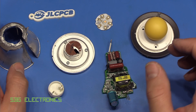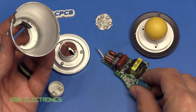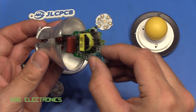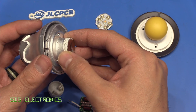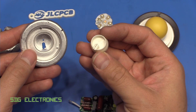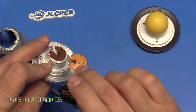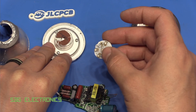We finally got this fully apart, and that was really quite a mammoth task — it was built to be extremely rugged with the insides never designed to see the light of day again. The PCB was sitting inside this aluminium casing and then fully potted under vacuum, making it completely waterproof — no way any moisture would get in. There was an external plastic coating with the Philips logo, and a strange plastic assembly to stop the potting compound leaking through to the top section, feeding the conductors through to the LEDs. The PCB is mounted with a thermal glue and also some other thermal interface material. Generally speaking, this was actually built extremely well.